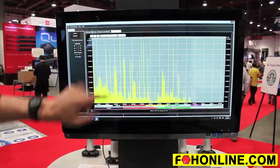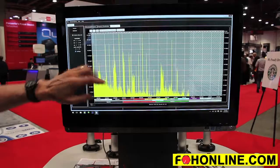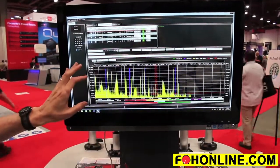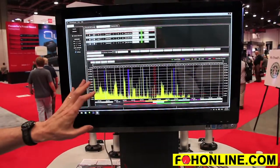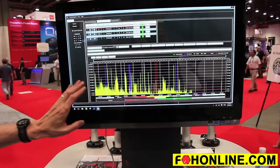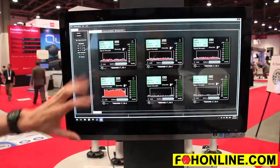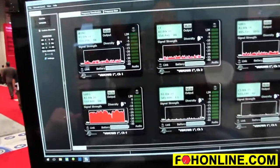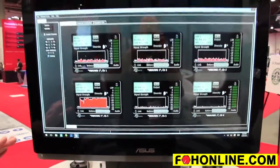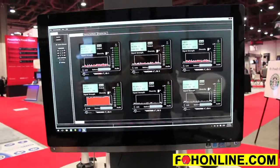Wireless Designer is a software system that does a frequency scan. Here we can see DTV channels and a bunch of wireless microphone carriers. That information gets sent over to our frequency coordination engine, where it will automatically calculate good frequencies based on the scan information — so it's great real-world scanning and implementation of frequencies. Then we can monitor all our channels — as many as you want. This is scalable so you can have all your channels up on one screen at once, and you see ten seconds of history on every channel, which is a very handy feature for keeping track of your wireless system.